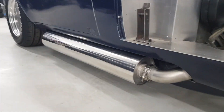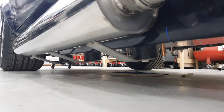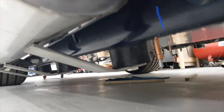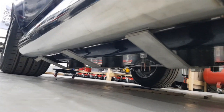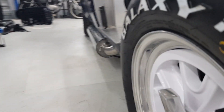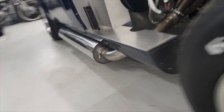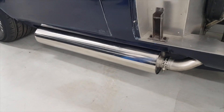The car is on the jack — sitting really low on this side, the other side is up. That is the 40 by 70mm mount fitted, and that's the exhaust just resting on the brackets, ready to be tacked on. Looking down the lineup I'm happy with it and happy with how it sits, so that's what I'll be moving forward with.